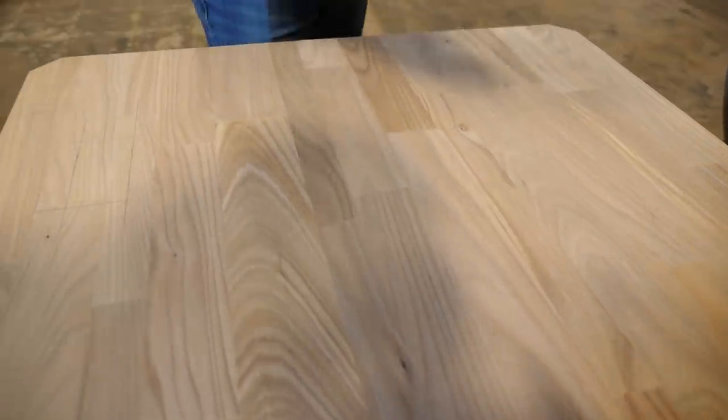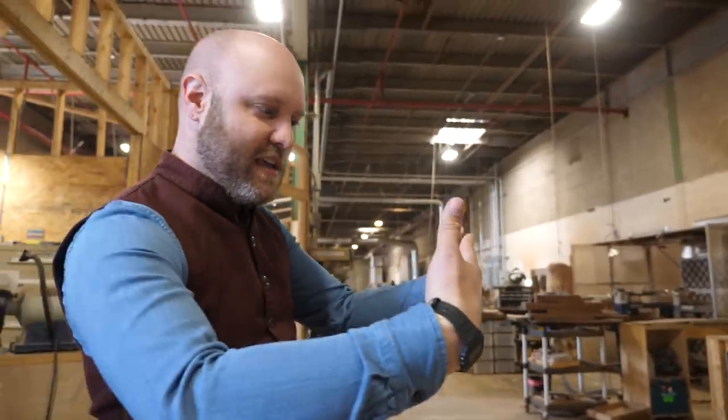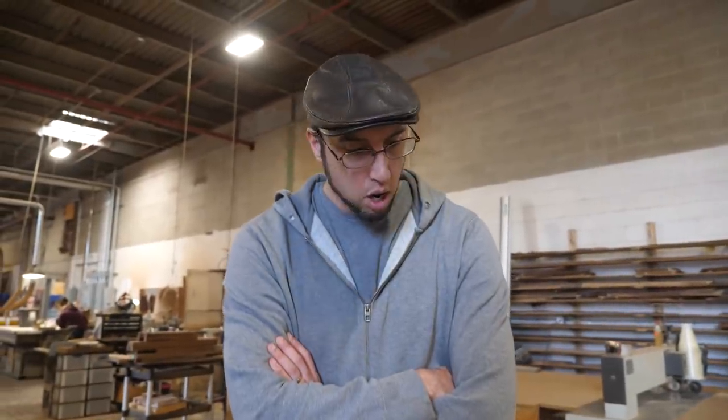The first thing I noticed was this is the first piece I have ever seen Wyrmwood do that is finger jointed. Finger jointing gives that butcher block look to it. Instead of having full pieces of six-foot or five-foot wood that you laminate together like MGT toppers, you can get smaller pieces of wood and join them with finger joints — the joint literally looks like this. You glue them together, which saves on waste, driving wood waste from like 30% down to like 5%. It's insane. Finger jointed panels are also more stable — the more pieces of wood you're gluing together, they stabilize each other. This will be a very, very, very stable top, and it's very attractive.